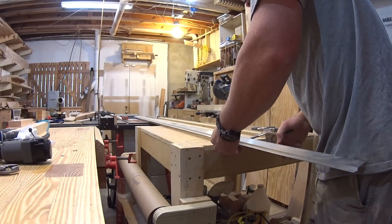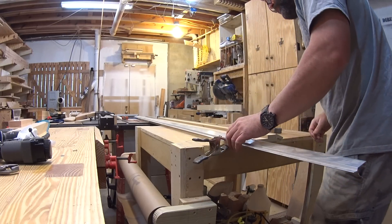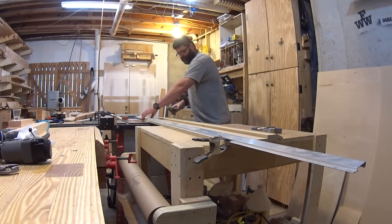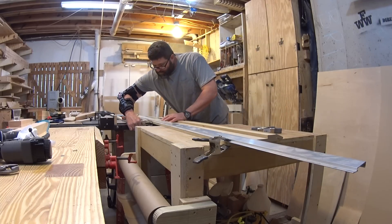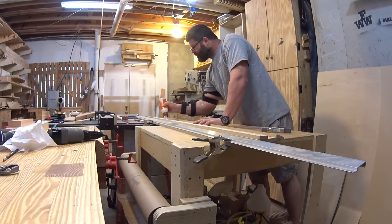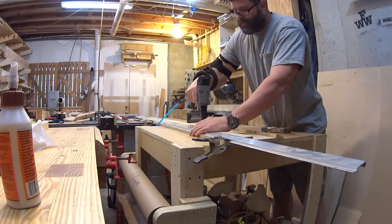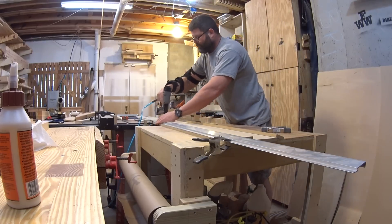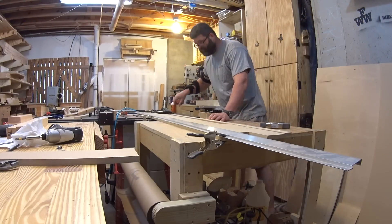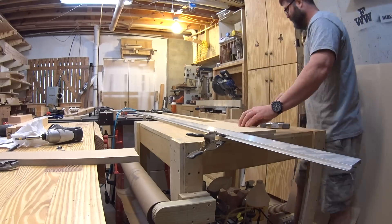I went a little overboard on the assembly. Although there is a straight factory edge, I still like to use a separate straight edge so that I can have a wide, thin area for clamping. I figure anything worth doing is worth overdoing. I put a line of glue on one of the dovetail strips, making sure not to put the glue too close to the dovetail cut. Glue squeeze out would be disastrous inside a sliding dovetail, so it's best to avoid it altogether. I shoot some three quarter inch brads with the nail gun to hold it secure until the glue dries. Then, using the 16 inch base plate as a guide, I glue and nail the other dovetail strips, sliding the plate as I go, being careful of the glue squeeze out and making sure it's snug but not too tight.